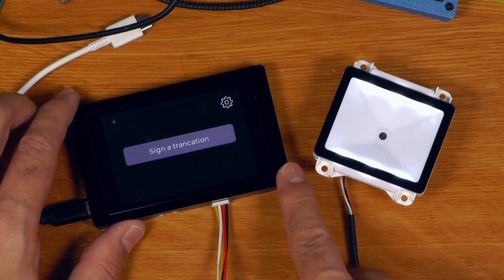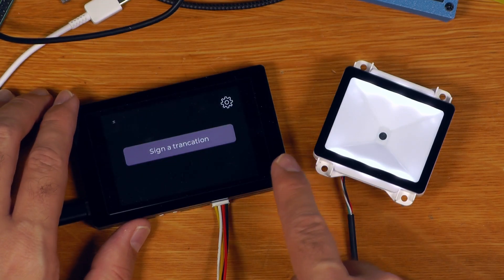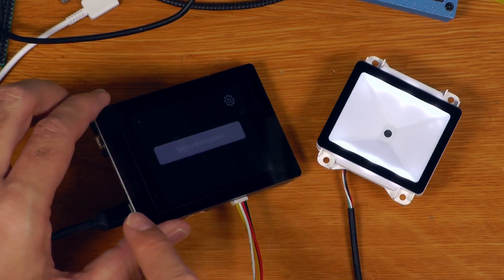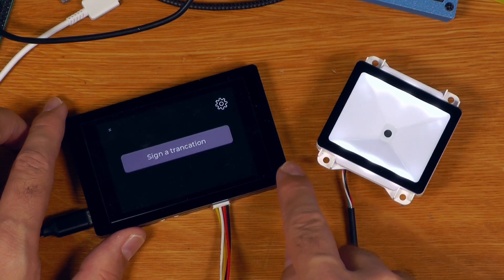The hardware security for Keyflint is low. Even though this is an ESP32 board just like the Jade, because it's using the Arduino stack, it's not as straightforward to lock the hardware down and use things like flash encryption and secure boot. It is very easy to reflash malicious firmware over the top of this device, and as a user you would not know that it happened.